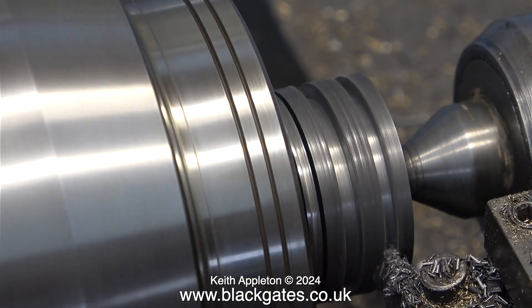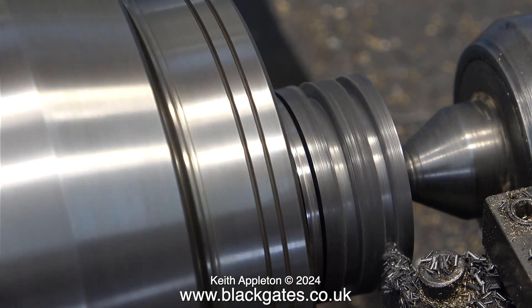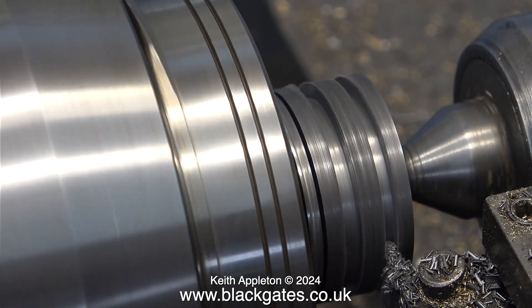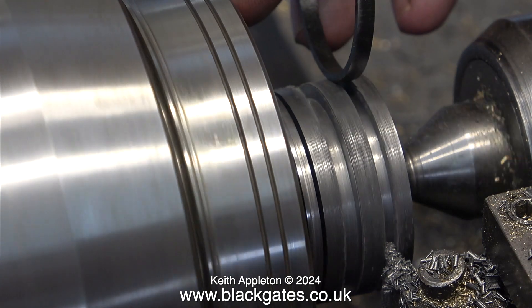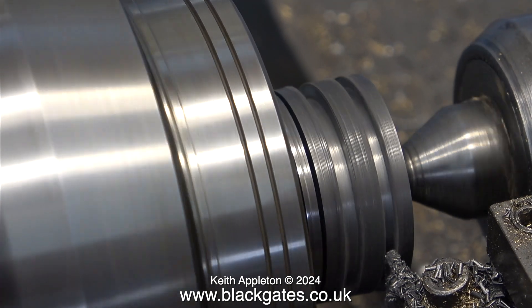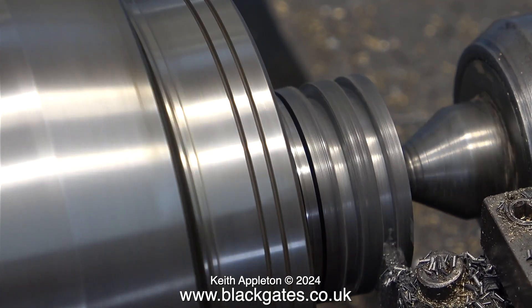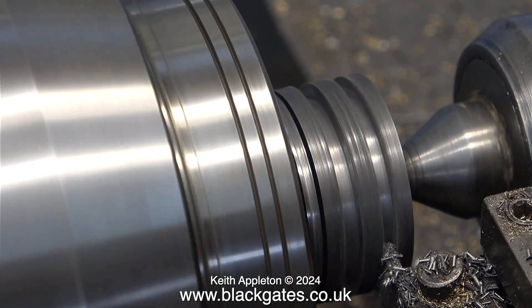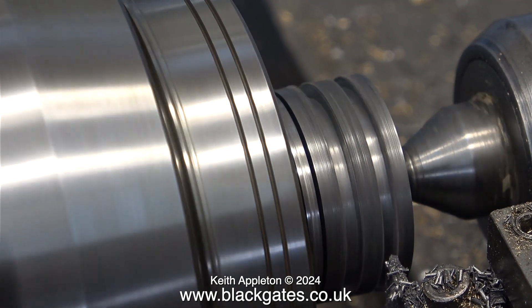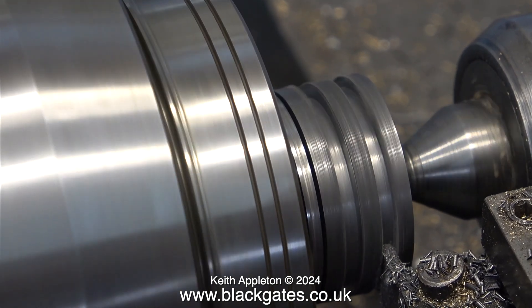Time now to cut the other groove in exactly the same way. Although I made a slight mistake — I miscalculated the one eighth of an inch thickness — but this is really not important. Here once again I'm trying the piston ring in the other groove and there's a fair way to go yet to open up the groove so the piston ring fits. I actually like doing this; the nervous tension knowing that the job could go spectacularly wrong at any minute sort of gives me a bit of a buzz.